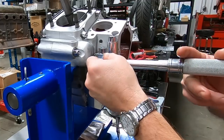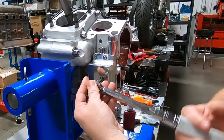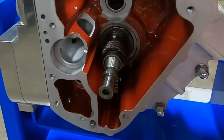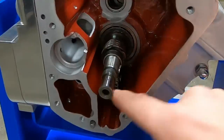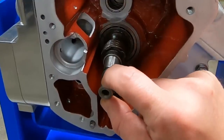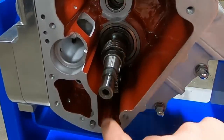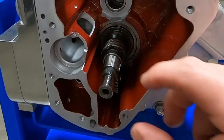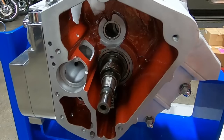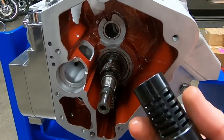I'm going to check my gear, make sure everything's moving nice and smooth, rotate it around a bit - gears floating fine - and then we're going to torque this down. I believe this is one of the attributes of these old nose cone engines that made them so resilient over the change to the Twin Cam. Crankshaft runout matters, but having the shaft like this, the oil pump itself is not completely reliant on the runout of the crank. It's driven by this shaft here, so if you have a little bit of runout, it's not really going to directly affect the pump. This side of the pinion shaft is supported by the gear case cover. You always want to check the bore in here - they do sell oversized. This one fortunately has not been damaged. I did very lightly hone it just to clean it up a bit, but I'm still well within tolerance on our clearance.